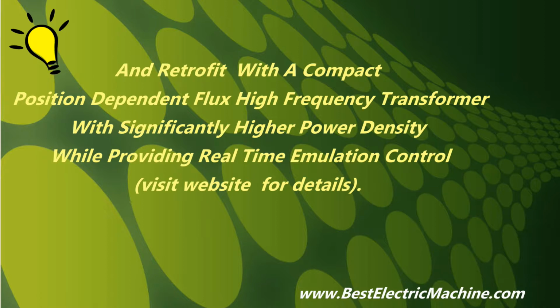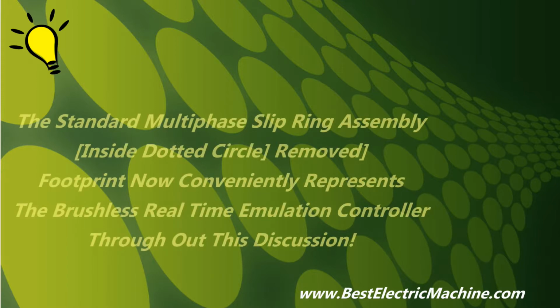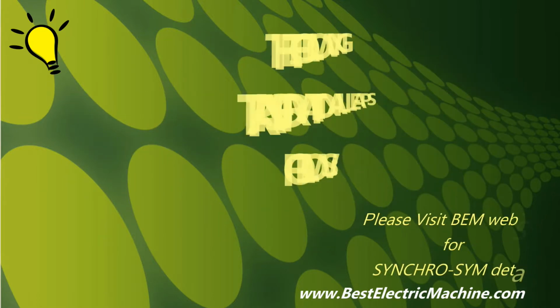Multiphase excitation power is supplied directly to the rotor active winding set in order to eliminate any functional reliance on reluctance or slip induction with known speed regions of discontinuity and instability, such as about synchronous speed where slip induction becomes vague or ceases to exist. Replaced with a very compact, high-frequency, position-dependent flux rotating transformer of significantly higher power density inherently providing the analog processing for real-time emulation control, the multi-phase slip-ring assembly may well represent SYNCHRO-SYM's brushless real-time emulation controller assembly and accordingly, at least the following transformation leaps in price performance result.